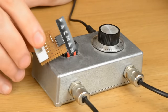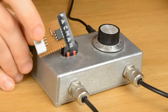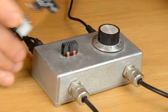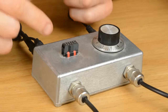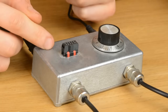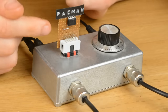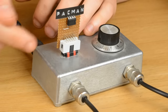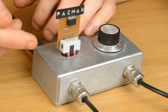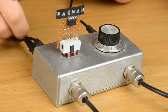No matter what we do, we cannot get that chip to run code directly from this cartridge. So what's going on? What we do have the ability to do is write to our own program memory. So when the game cart is plugged in, the first thing the BIOS does is copy the entire cartridge onto the flash memory, and then jump to there in order to run it. If you think that doing it this way is stupid, you'd be right.